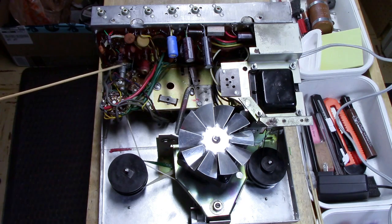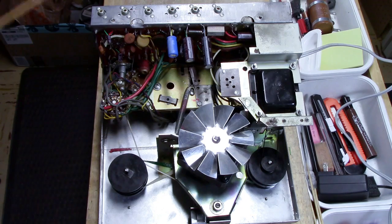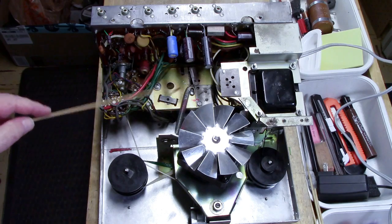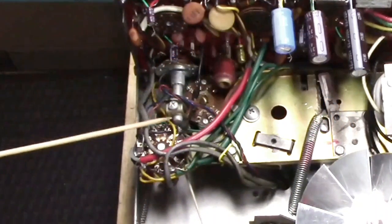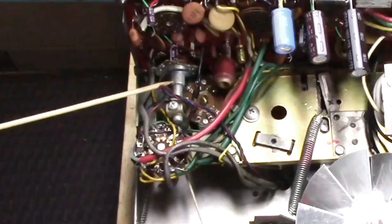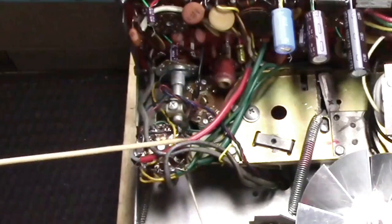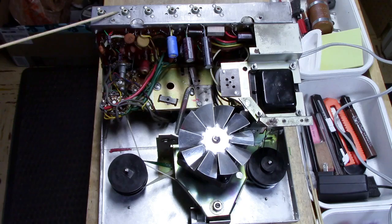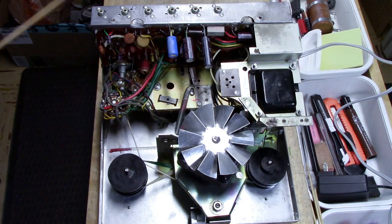Here's the electronic circuit — this is a tube machine but I've taken the tubes out to work on it. All the mechanical parts that turn the machine on and off, put it into forward, reverse, rewind, fast forward and so on are all controlled from the mechanism located under this plate. How are you going to get underneath that plate? You can't. You've got a switch here wired to a circuit board with a spoke going up to a clamp — that's your record/play switch. Here's another switch that handles the stereo/mono, bolted to this area. There are two hex head screws you can't even see through the wiring, and this doesn't move. To take that out you'd have to undo all sorts of rivets, so this chassis doesn't come out easily. I spent months on this machine and I just can't get it apart, and the Sam's Photofact is not really helpful for that.